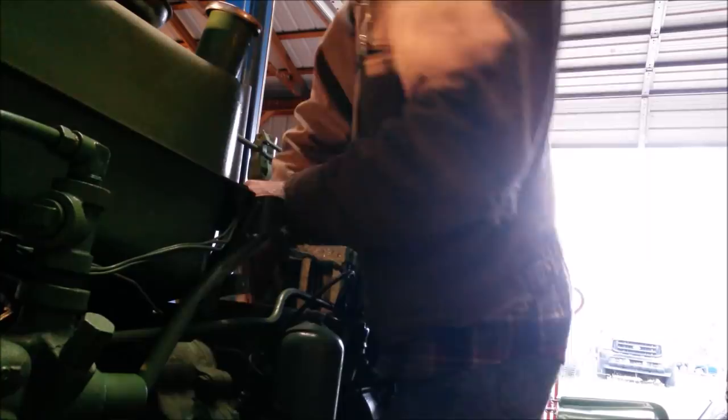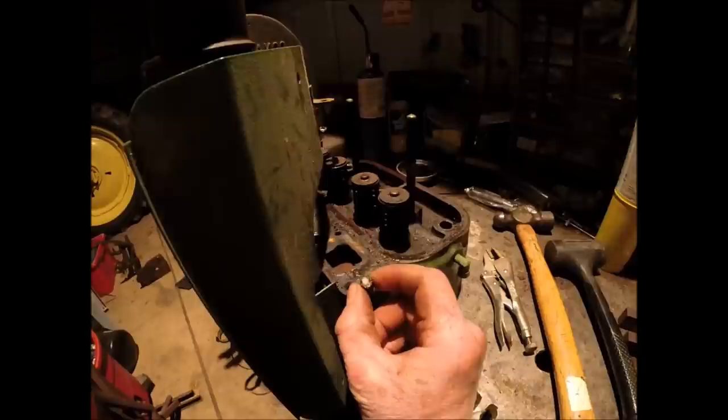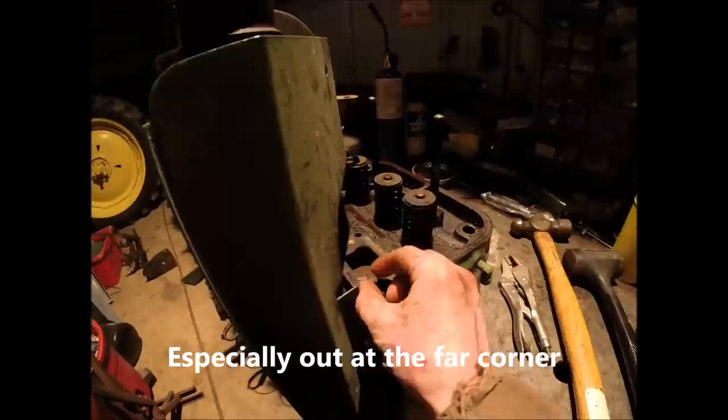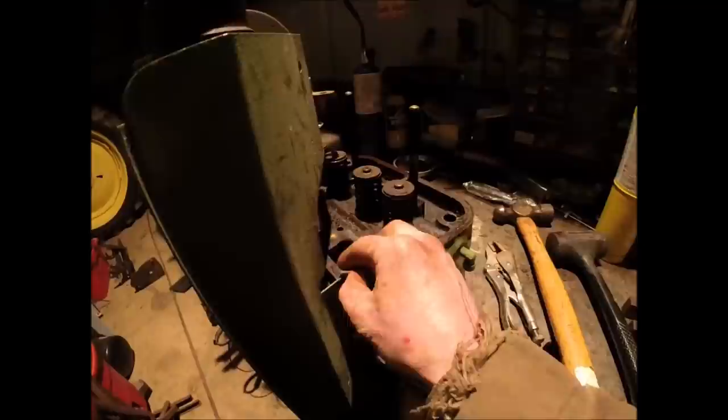So before we get into the valves on this thing, just going to take a quick side note. I just got this broken off bolt out of the head. It was really in there. Wouldn't move with the vice grips at all. And with an iron head, there was concern with cracking the head with putting heat on it. So I figured this might be a little useful tidbit. I've done this several times successfully. It's the corrosion in the threads that this gets all bound up on.